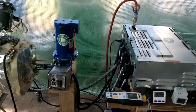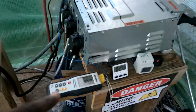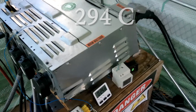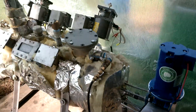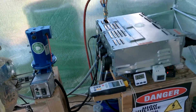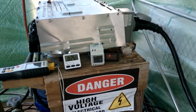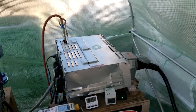We're at the 24-minute mark. Right now, the current external temperature of the body of the reactor is 561 degrees Fahrenheit, or 294 degrees Celsius. So within just less than 30 minutes, it's already above 500 degrees, and that's the metal. So the actual surface of the plastic is going to be even hotter. With all the stuff on, we're consuming 42 amps, 4,800 watts, and so far we have consumed 1.46 kilowatt hours of electricity, with a power factor of 0.96.